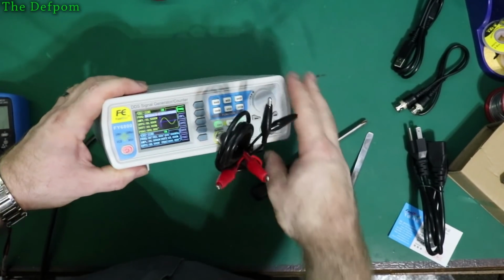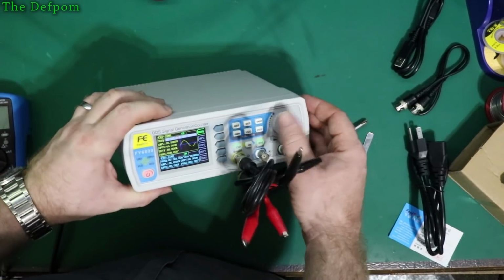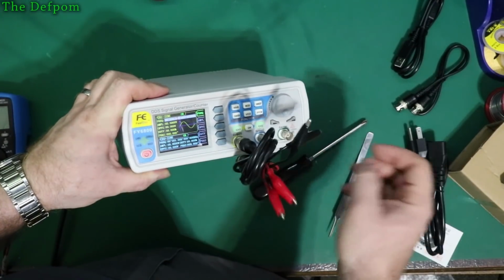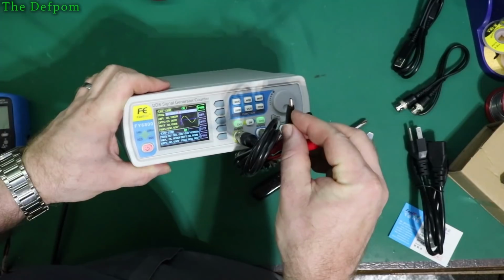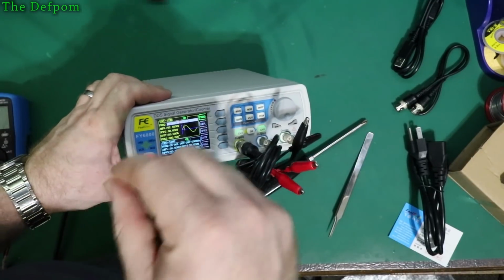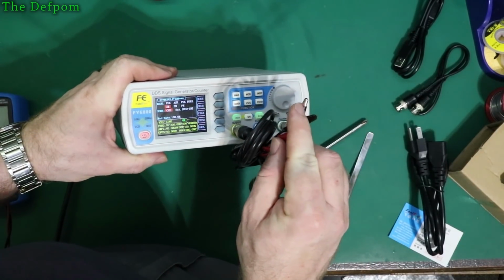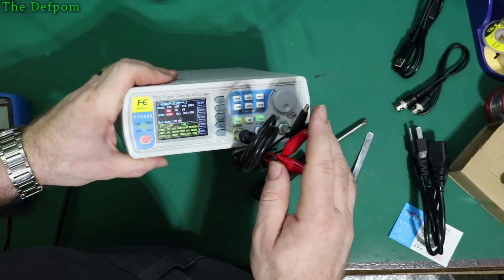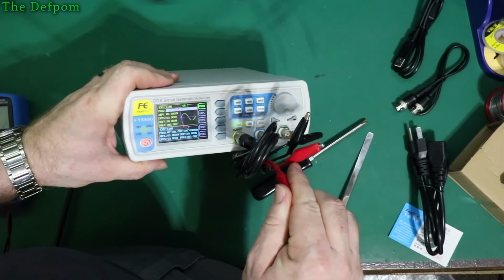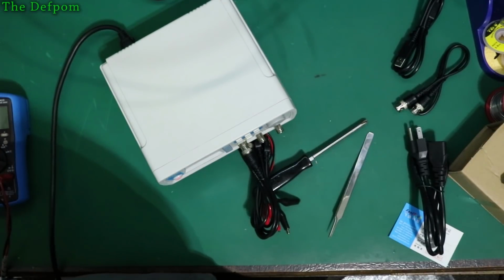Right, so I thought I'd just try this out using my CB over here as a receiver. I've got it set to 26.330 megahertz, which is a channel 1 frequency for that radio sitting over there. And you can hear it's got a buzz, right? That's the DDS noise. It's not perfectly stable. There's noise coming through with that DDS signal. If I turn modulation on, you can hear distortion in it as well. It's not perfect. So unfortunately it's not really suitable for that kind of work.